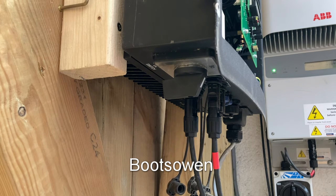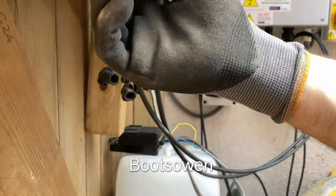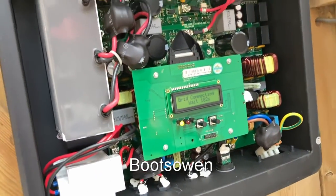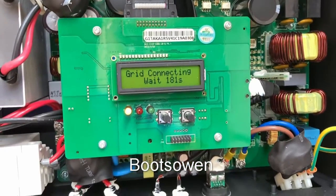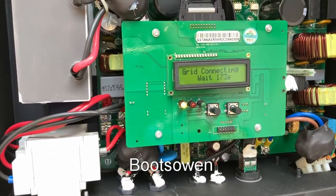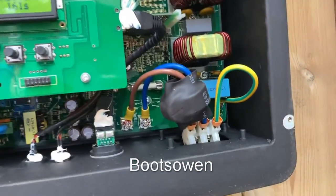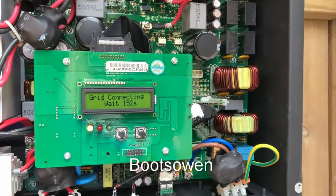Should all be live for mains. I'll turn on the DC over on the wall — this is coming from the solar panels. Turn it on underneath up here. There we go — yellow light. On-grid inverter, grid connect. It's got a three-minute startup by the looks of it. It's whistling in a bizarre electronic way. 181 seconds, so it's three minutes to go — quite slow startup. It should have about 190 volts on it at the moment and there's no sun right now, so it shouldn't put out much more than 100 watts. Very clean inside — I wonder if it's ever been opened. There's a big 20 amp fuse in there.